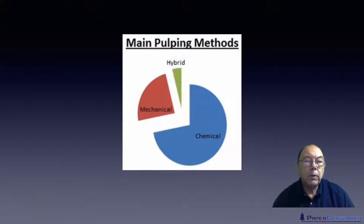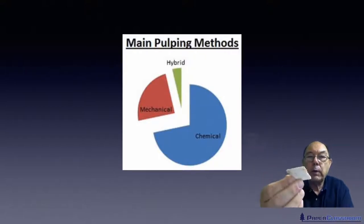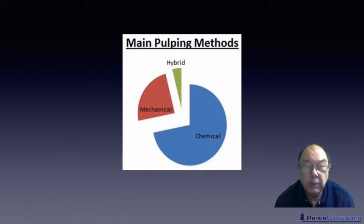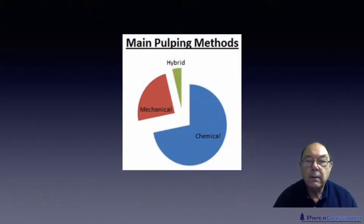With chemical pulping you take a tree, chop it down into wood chips like we've seen in a previous video. So here's some wood chips that we use. We cut them down into these wood chips, we stew them up for a long time in various ranges of chemicals at usually high pressures and high temperatures. We eventually dissolve away all the lignin — the glue that holds these fibres together — and you're left with just the fibre. The disadvantage of this method is if you start off with a ton of tree you only end up with roughly half a ton of fibres, because the remainder you've dissolved and poured away.